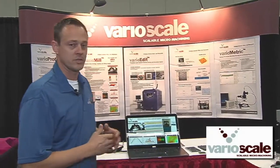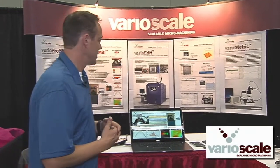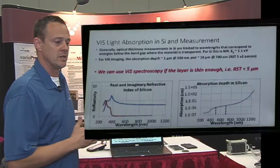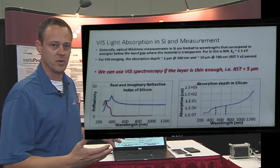This image was just taken with a stereo microscope, nothing special, and you can see right through it with the naked eye. So what we want to talk about is measuring thickness of silicon. Generally it's reserved for wavelengths representing energies that are below the bandgap so the material is transparent.